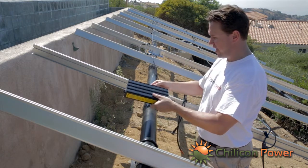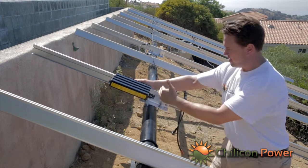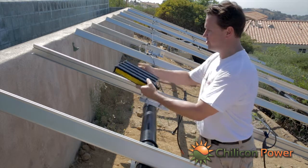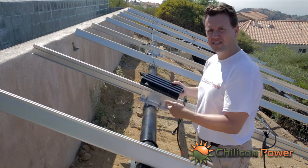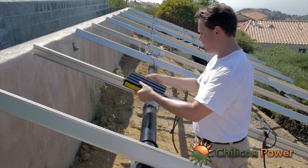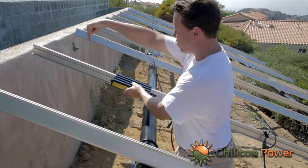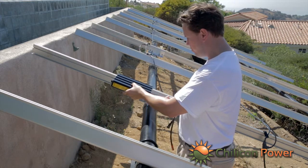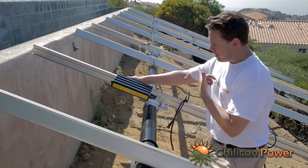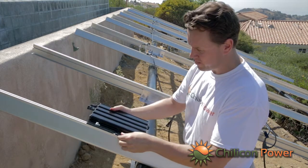The issue would be that the LED location, if you went here, would be facing down the slope in this particular site, and these panels will be the last thing installed here. The panels will be installed from the bottom up, and the PV connections will be made one by one as they're installed, so the installers will be uphill sliding the panels. Then we'll clip these. That won't be that bad, but then they won't be able to see the LED blinking unless they come underneath and look up. So a better location is this side.